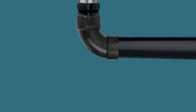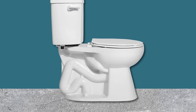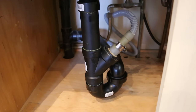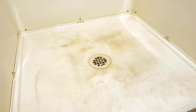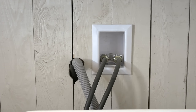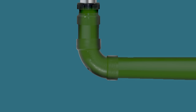Number twenty-five is not installing a P-trap. Any fixture with a drain must have a P-trap installed as it keeps sewage odors from coming into the house. A toilet has one built into it, so there's no need to install one. However, sinks, showers, bathtubs, floor drains, and washing machine outlets all need one installed. If you have unpleasant odors in a specific room, it's most probably because there's a P-trap missing.